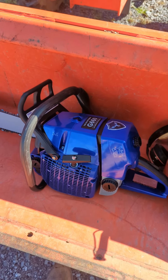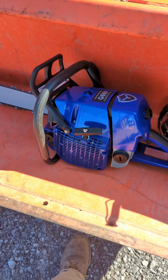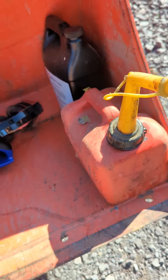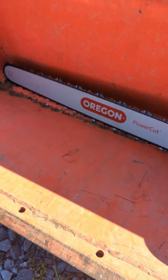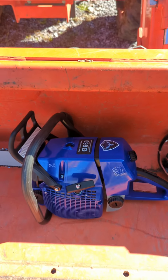Apparently when you put that in Google and translate it to German, it means "wood format." The instructions said to put weed whacker gas in there at 32 to 1, not 50 to 1, so I mixed that up. I bought a 36-inch bar with a 3/8 chain, and I have never started this thing before, so let's see how she goes.